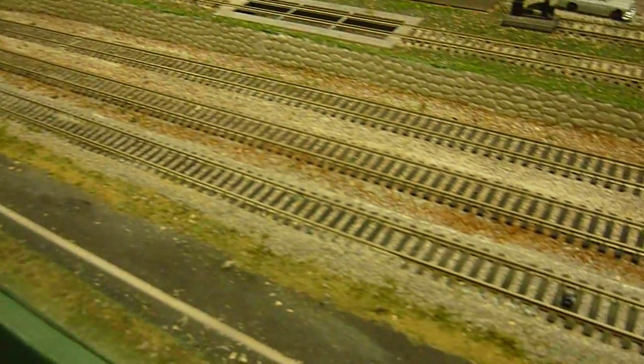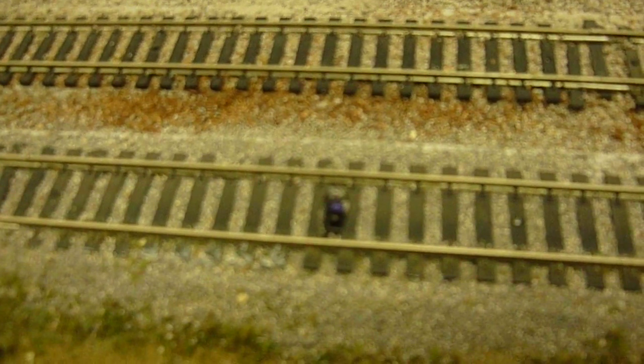Here in the track, we have an infrared LED and phototransistor pair, and we have a second infrared LED phototransistor pair. These sensors are 24 inches apart, but you can put them any distance that you want — you just have to put into the code the distance that your sensors are apart.